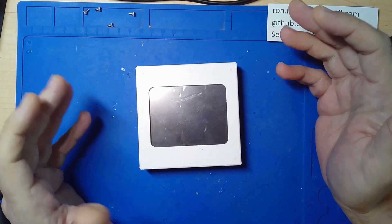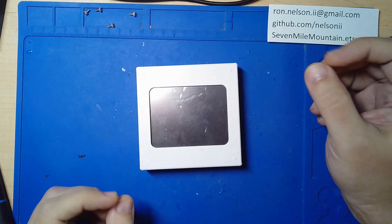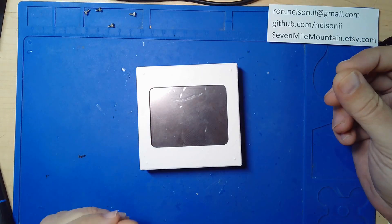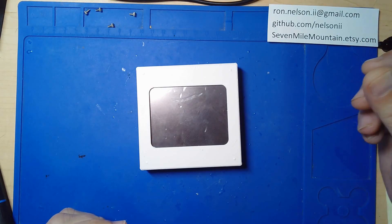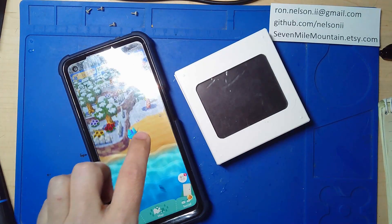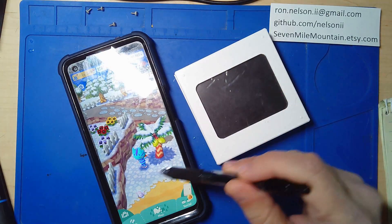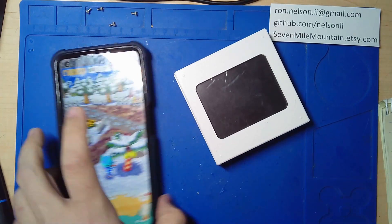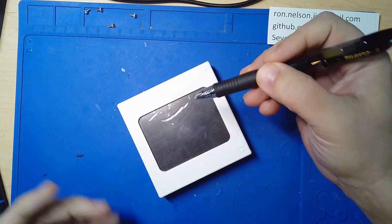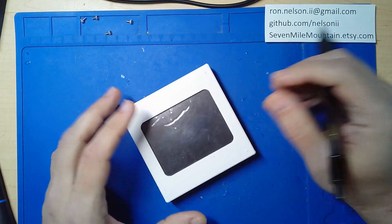Once again, I'm going to be revisiting old technology for use in current problems. One of the things I found with touch devices is that most are now capacitive based. So for your touch screens or track pads on laptops, it uses a capacitive feature, which relies on the electrical connectivity of your finger or a conductive stylus. But the old hard plastic stylus like this pen is not going to work. There are situations where folks use a prosthetic device or a stylus, and very often a long fingernail, to try to move their track pad around — and that just won't work with a capacitive one.